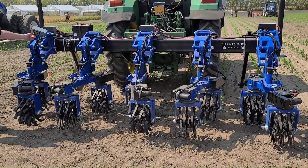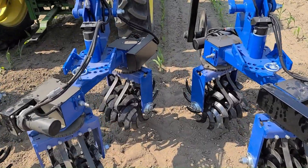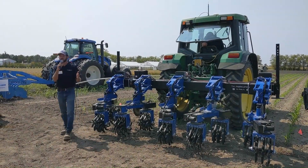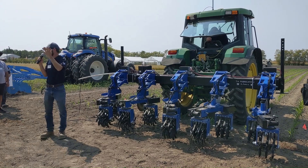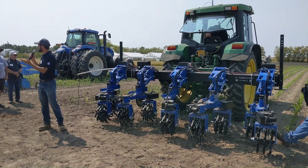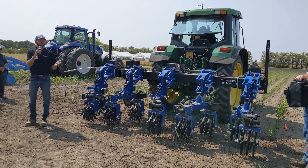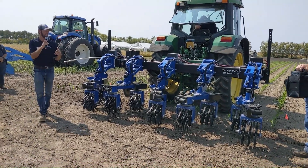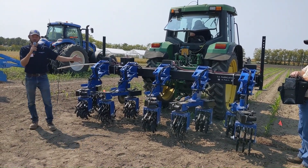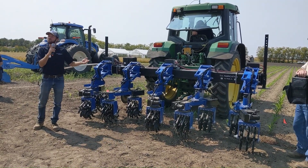The Lilliston — our swinging spider cultivator — is very unique in the way it moves dirt and interacts with the soil. Every other cultivator is a different configuration of sweeps and shanks. There are advantages to that, but also disadvantages in certain circumstances: one being wetter conditions, speed issues, or the fact that we can pull away from the row, which is a unique thing.